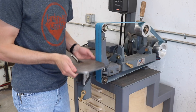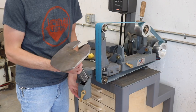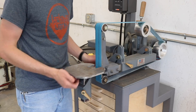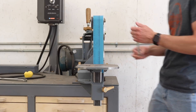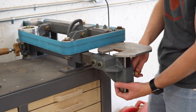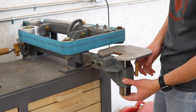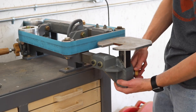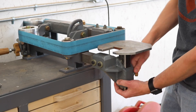The holder is designed to hold tables that have a vertical inch and a half post on them. This makes a table really easy to build and it also makes them indexable. You can just turn it 90 degrees and the table holder can slide in and out on this horizontal bar. Probably the most important feature is for when the grinder is in the horizontal mode — in order to evenly wear out the entire surface of the belt you need to be able to move the table vertically. Because of this vertical post design you can move the table straight up and down without changing its angle or its horizontal position. As far as I know this has never been done before.